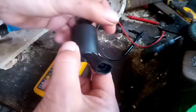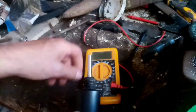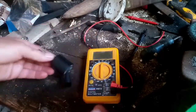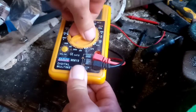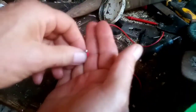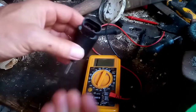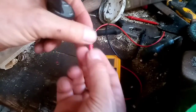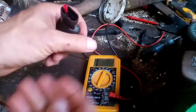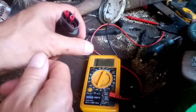This is one of the old ones, so I was just going to show you what I did to see what was wrong with it. It goes up to a thousand ohms, so you get your multimeter and swing that round to 2000 - that looks the right sort of scale. I had a bit of trouble; the pins are buried deep in here, but I found these little badges worked really well. If you slot them in - it's pin one and the middle one - you put them in there and they make contact.